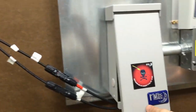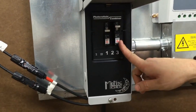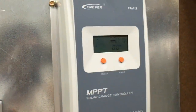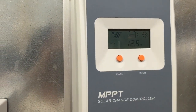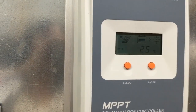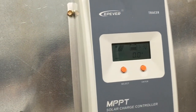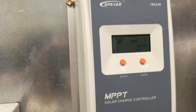I'm just putting this together roughly for demonstration. We'll flip on this breaker here, which lets the power pass from the battery bank to the charge controller. Now we see it's engaged. There's a moonlight symbol right now because there's no solar connected. Now that we've turned it on and the solar is connected, it's trying to make power — but obviously there won't be any power production right now because we're inside the building. This shows the battery bank, and here we see the amperage coming in. It will swap back and forth showing you multiple outputs, as well as your system voltage, so you can easily check your inputs each day or anytime you want to.